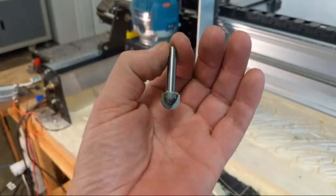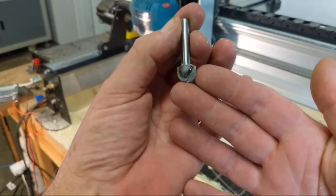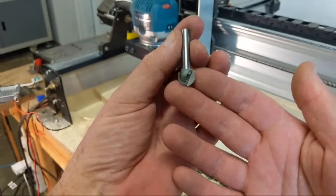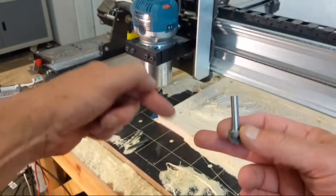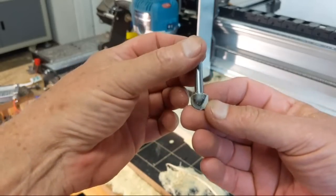First of all, we're using the big stiffy half inch ball nose. It's one of the more popular ball noses that seems to move through the IDC store. It's a good size for cutting your juice grooves. I also want to show you how to do a tapered juice groove, meaning it actually goes downhill into the bowl of the juice groove, the juice catcher.